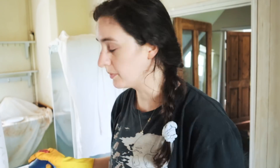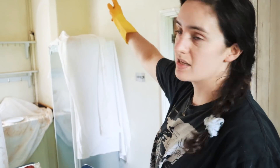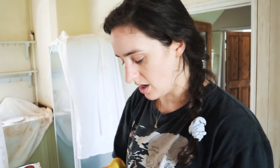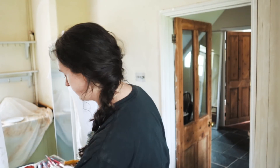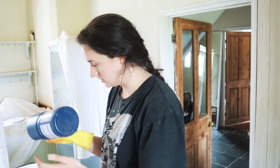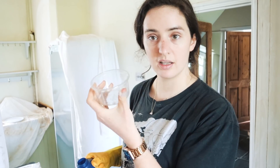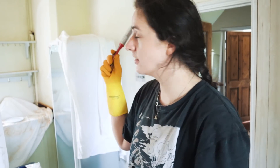Before I do anything, I'm going to do a test patch. I think I'm going to do it up here because there's an area which is really hidden — we might box it in. I couldn't really get in there with the sander, I had to hand sand it a little bit. So if the test patch looks awful, it's hidden away. I'll wait until it lightens. I'm taking the bleach and pouring it in a little hummus container — oh, it's quite thick. I've got a paintbrush, and I'm just going to go up there and paint a little section.